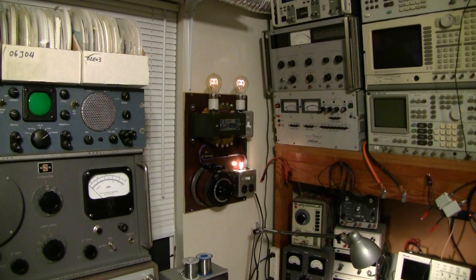Adding some capacitors to the primary side of the isolation transformer will take those light bulbs down quite a bit — maybe around 12 microfarads of AC capacitors would bring the brightness of the bulbs down a fair amount, just optimizing things. But I don't think that's going to affect me in any major way. It's okay the way it sits. When I'm pulling load, if there's a short circuit it will happen well before the Variac is at maximum.